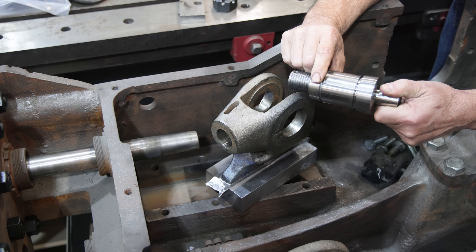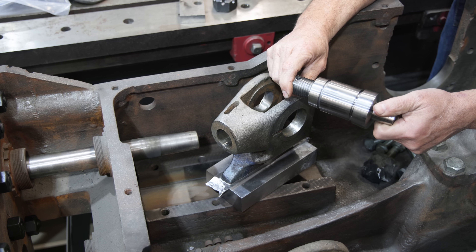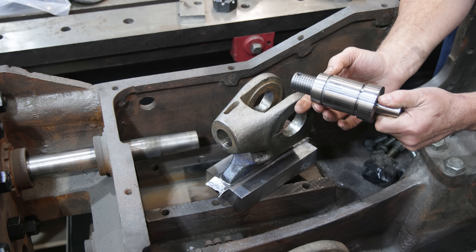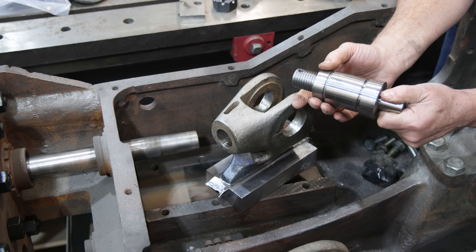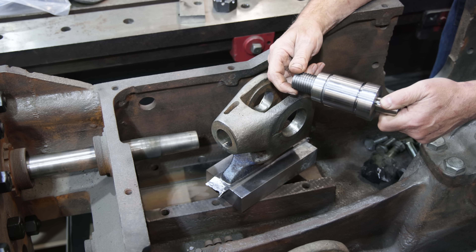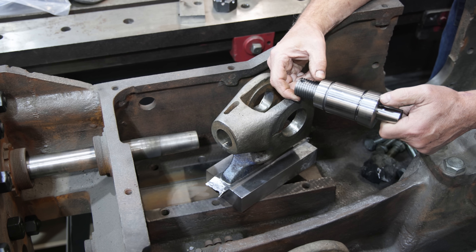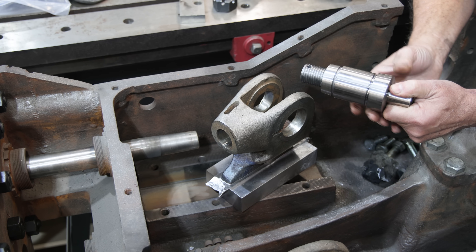Case hardening makes them extremely tough. The low carbon steel is not brittle — it will bend, it won't just break. What you have to do is put carbon on the outside and go through a heat treat process. The carbon actually absorbs into the steel and you end up with a layer of hard material right at the surface while the rest of it remains relatively soft. We're going to have to actually do that heat treat process and case harden these.